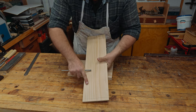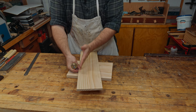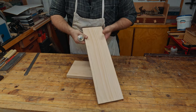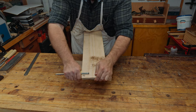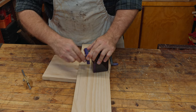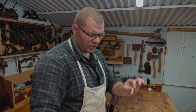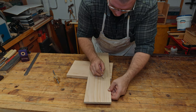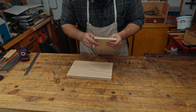I'm just going to wrap this line all the way around. It doesn't have to be particularly deep — it's just a reference for us to saw next to. We won't saw right on top of it; we'll saw just next to it so we've got a little bit of play. Because I know both sides of this timber are square, I can run a marking line off the other side to simplify the process. It's good to have a nice sharp pencil — this sharpie gives a very sharp point, allowing you to slot it straight into the marking gauge and knife lines so you can see your line.